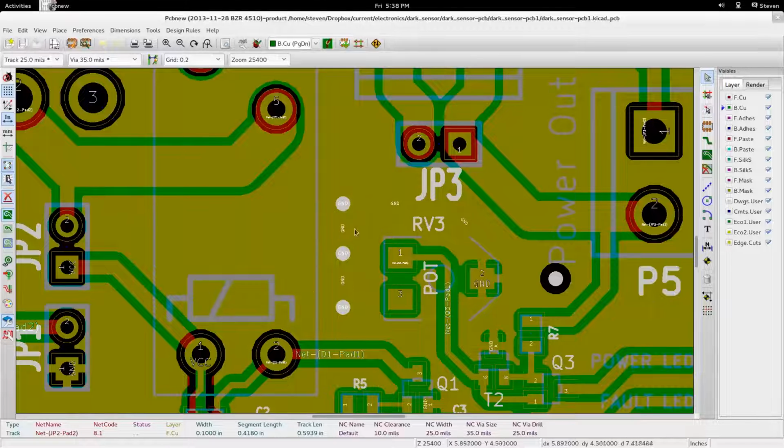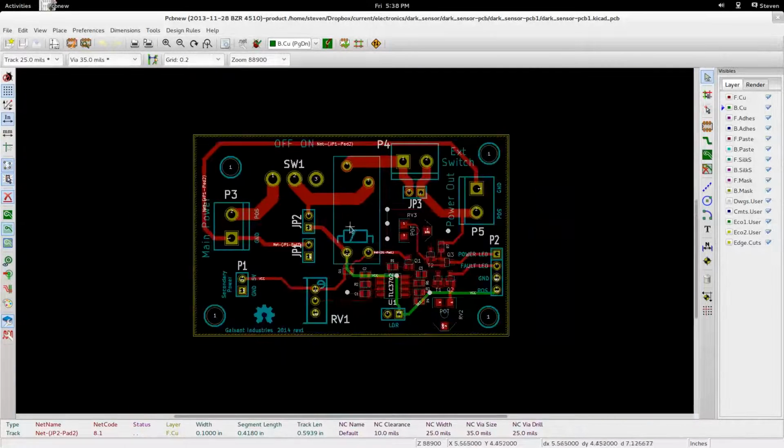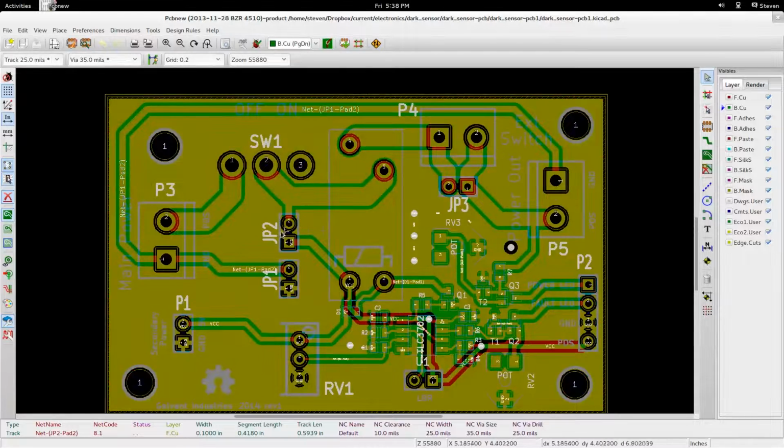So this is just a couple of vias to stitch the two together, because I was looking, and without them there, ground would have quite the distance to travel. So all the ground that was located around here had to go through these little sections and whatnot, until basically back to here in order to join together with the bottom ground plane. So I just added a couple of little vias there, just to give it a little bit of a path.